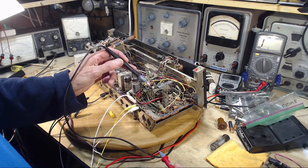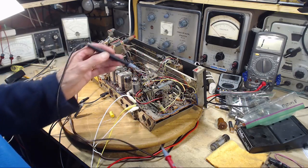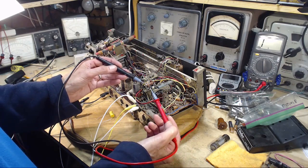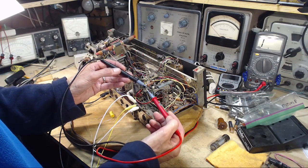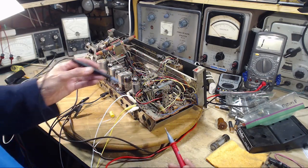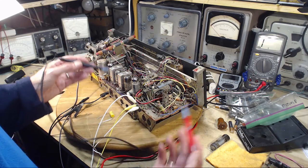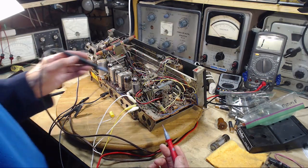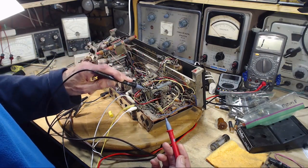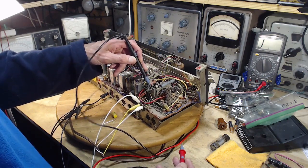This resistor is probably rated 1,000 volts too, although we don't usually think about voltage ratings on resistors. But if you tried to drop, for an example, 20,000 volts across this resistor, I think the electricity would just travel over the surface of it. It would just leak over the surface of it. In fact, it would probably go pretty quick. 20,000 volts, a bit extreme as an example, but so 1,000 volts here to the chassis. Up to 1,000 volts. Doesn't mean there's always 1,000 there.